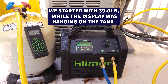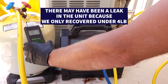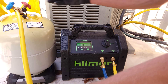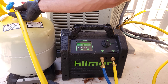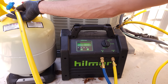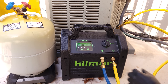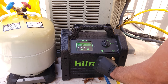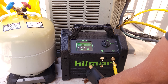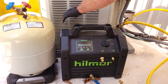You're going to have some refrigerant in this hose when you disconnect — there's no way to really recover that part. We have almost four pounds out of the system. You always want to use a short hose from the recovery machine to the tank. We can go ahead and disconnect at the input for the recovery machine and remove this outdoor unit and cut the line set, because there's no refrigerant left in the tubing.